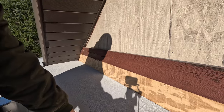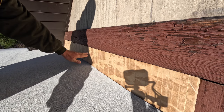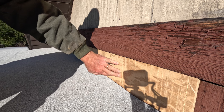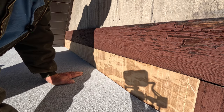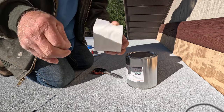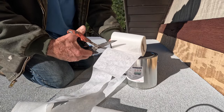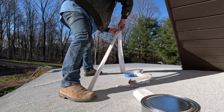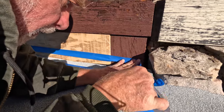The next step is to do the flashing. I brought my membrane right to the plywood or to the wall — this is T111 siding. I'm going to show you liquid flashing. It comes with a fleece — a polyester fabric — this is the secret to the whole thing. It comes four inches wide; I'm going to cut it down to two inches. I take my fleece, cut it in half to get a two-inch width.